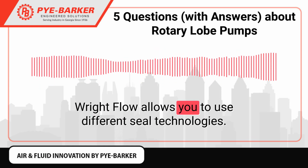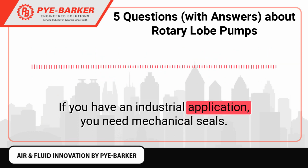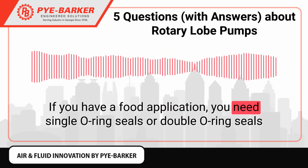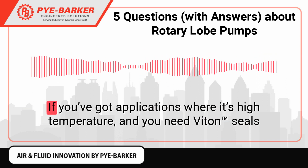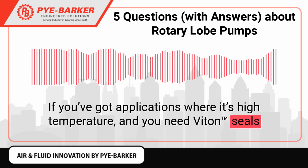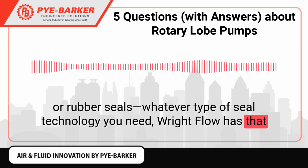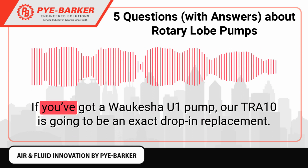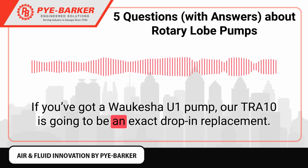Right flow allows you to use different seal technologies. If you have an industrial application, you need mechanical seals. If you have a food application, you need single O-ring seals or double O-ring seals because you're running high pressure. If you've got applications where it's high temperature, and you need Viton seals or rubber seals, whatever type of seal technology you need, right flow has that type and the capability to do it on that pump. If you've got a Waukesha U1 pump, our TRA-10 is going to be an exact drop-in replacement.